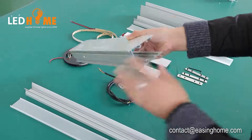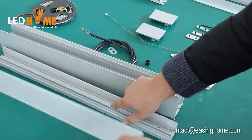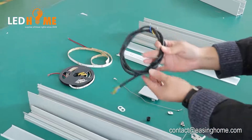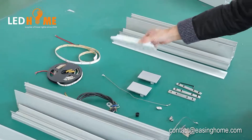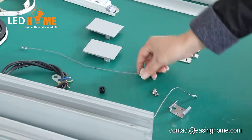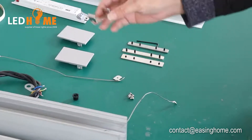This is the aluminum profile, 50 mm by 75 mm height. This is also an aluminum inside container, and this is a PC diffuser and this is the IP65 LED strip. This is the cable for 220 voltage power and this is the inside driver. This is the end cap, this is a safety rope, and this is the accessory — a connector to connect two pieces together. This is also the same. This is a screw and these are inside clips.